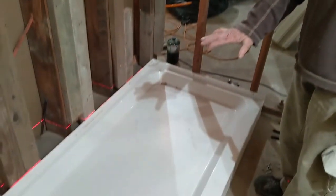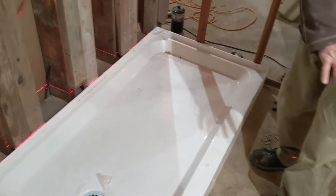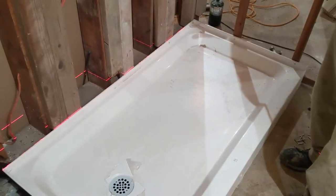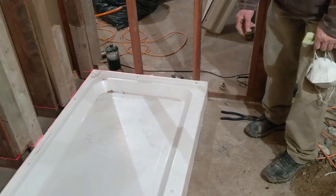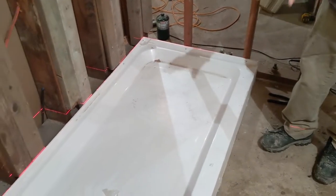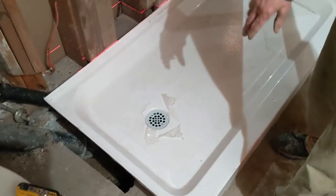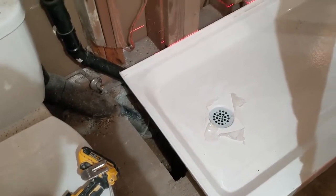So my friend, the shower is in place. This is how we install a shower on the concrete floor. First thing we have to do is break the concrete, and then we just have to work around it as it goes. We set it up, we used the laser to set up the level so it looks good, ready to be tested with water. Then once we test it and everything is good, we just throw some sand back in the hole and finish with the cement.